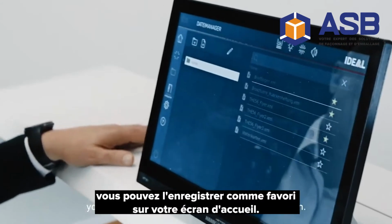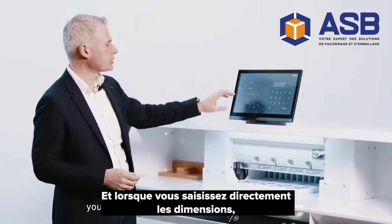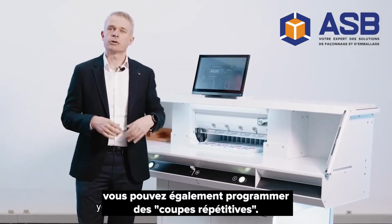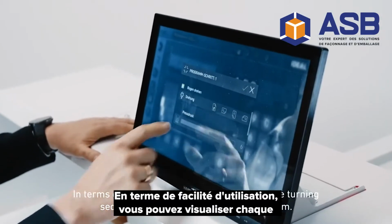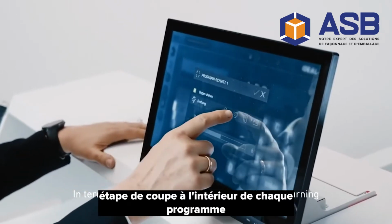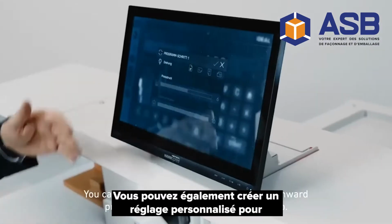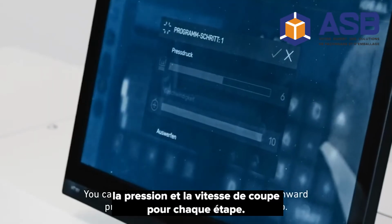Once you've created a program, you can save it as a favorite on your home screen. And when you input dimensions directly, you can also program so-called repeat cuts. In terms of easy operation, you can visualize the turning sequence for each cut inside each program. You can also create a custom setting for downward pressure and cutting speed for each step.